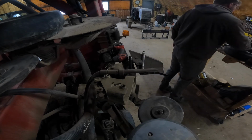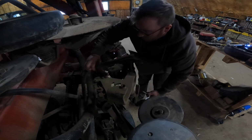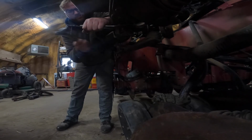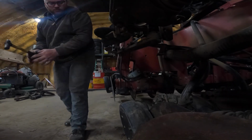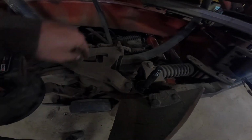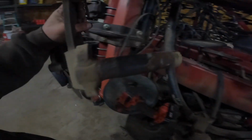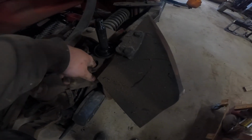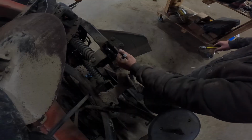Hub off. Alright, C-tube. 2 bolts. C-tube. Out of the way. Roll pin out. There's the whole arm. This whole thing pretty much sets your depth, but it's a little wore. It's not terrible. Down in here, there is 2 bushings, which we need to hammer out. There.